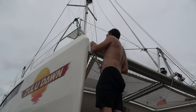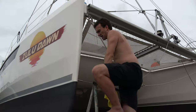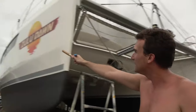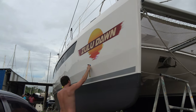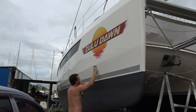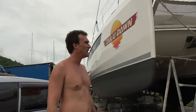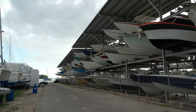Now the justification for tap testing: people say you're looking for trouble. But when you can see a blister from standing back this far from a boat, that justifies tap testing. When you buy a production boat, there's an expectation that it's going to meet a certain standard. Not resin-infusing the foam and fiberglass is just unacceptable — it doesn't matter what boat you buy. It wouldn't be acceptable on the boats behind you, and it's not acceptable on this one.